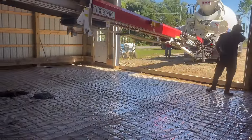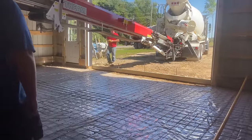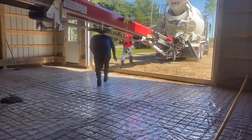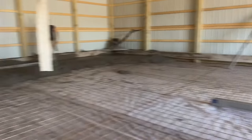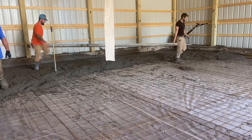Okay guys, we've got their new conveyor truck in here. He wasn't too far behind the first truck, so we're using that to get it in quicker. That first truck is dumping onto Sean's conveyor and we'll get him offloaded. We've got the back of our curb done on both sides — that's all filled. We've got a wet screed along the edge so we're where we want to be. We've got our power trowel staged here so that when we go to finish, we can scoot along the wall and grab it. This will go a lot quicker with this conveyor.